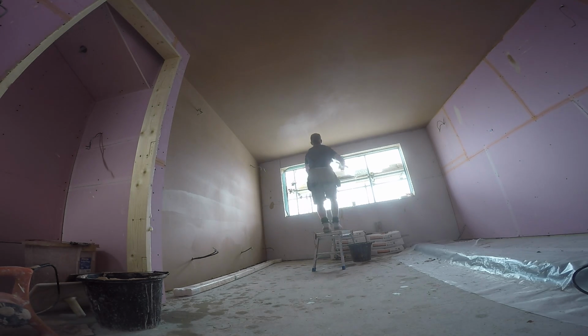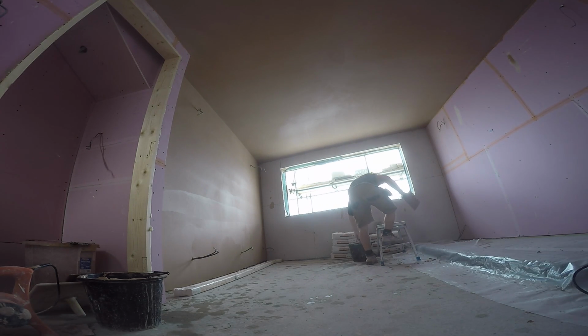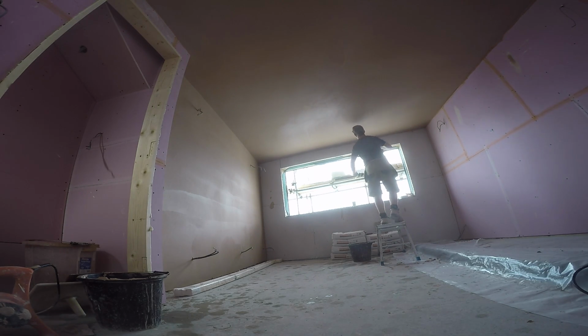So, yeah, it's going well. That's it. If you're at this stage, you're literally just finishing it, giving it its final trowel, just to give it a smooth finish, making it nice for the painter, and hopefully a nice matte finish. You don't want it too shiny or too smooth because it's a nightmare for the painter to finish with, but that's it. Again, same direction, finishing off, and if you follow this pattern and follow this method, you should get a nice finish.